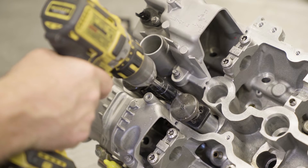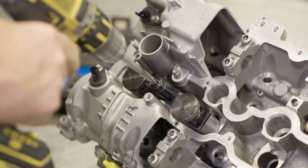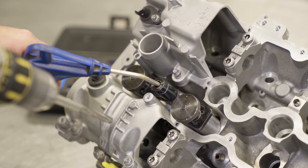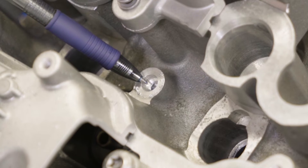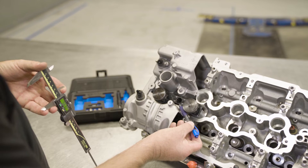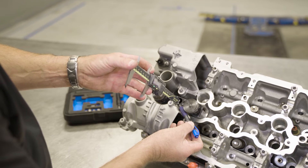Insert the drill reamer into the drill guide. Apply pressure and start drilling. After a few seconds of drilling, pull out the guide and drill and blow clean with compressed air. This hole is not fully drilled — continue drilling. To verify that the hole is fully drilled, measure from the surface on top of the guide to the bottom of the hole.